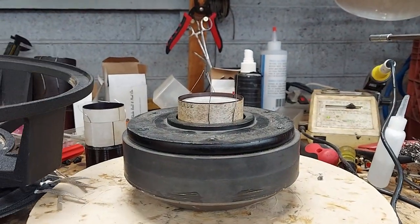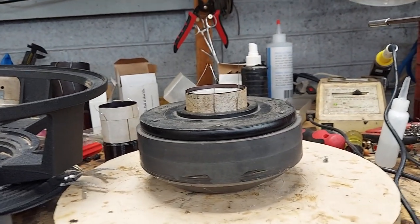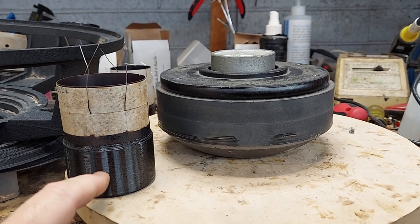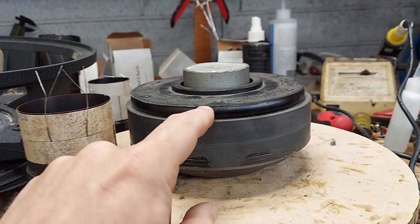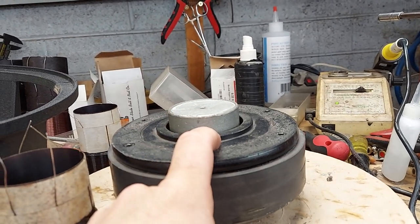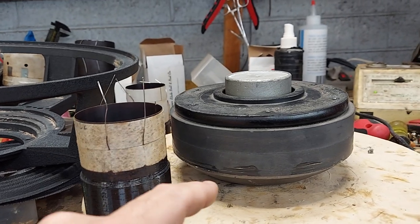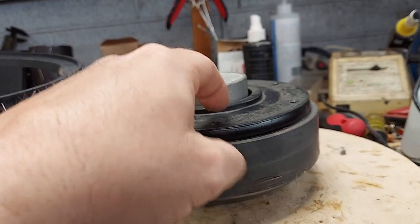Let's do a quick review. The idea is to find the center of the coil — this whole thing is 40 millimeters, so half of 40 is 20, so center is right there. You can mark it if you want. Then find the center of the top plate. In this case, the top plate gap where it meets the pole piece is 20 millimeters total. If it's 15, do half of 15; if it's 20, do half of 20. Find half of that amount and go north of center. But this one's a trick because it has a little platform up top that makes the actual gap thicker.